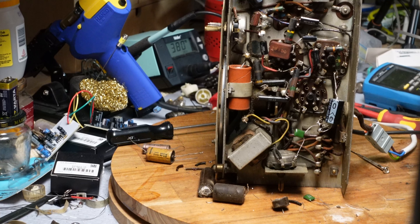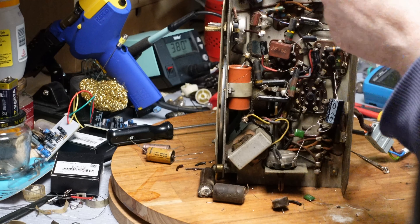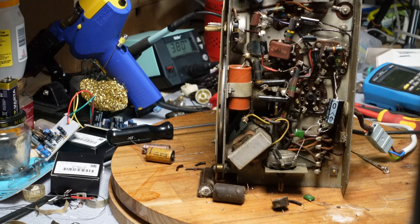Otherwise it's almost finished and working well. I haven't changed that one - I'm going to wait and see if I can get some more 0.047s, because I'm not really happy with these ones. They are working, but they're only rated 100 volts whereas the other ones are rated at 630, and I'm not sure that's really good enough. That's probably bringing in some distortion as well.